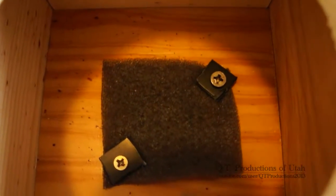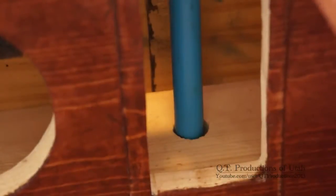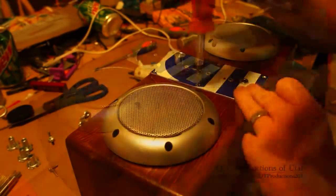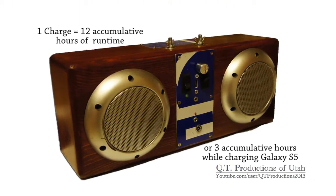I install metal mesh with thin foam on the inside of the breather holes, as well as quarter-inch T-nuts in the two holes on top and in the hole on the bottom. I tighten bolts into the ones on top and leave the bottom as is. I glue the Bluetooth receiver in, connect all components, screw them into place, and put felt feet on the bottom. It's finally finished and I can already see it being useful for a variety of things.